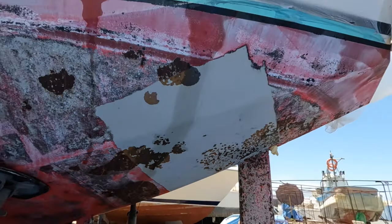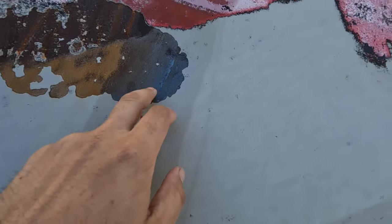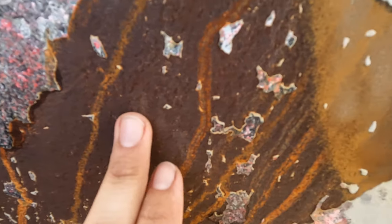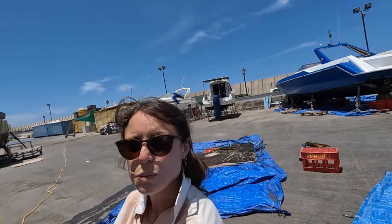It's a nice white patch where the anti-fouling is gone — we managed to get back to epoxy quite smoothly. But where we went down to bare steel, the flash rust has already begun. This is wet steel and it's immediately flash rusting in multiple spots. Everywhere we had a good surface for painting, the flash rust is remarkable. So going back to bare steel with this wet method on a steel boat is questionable — though you probably still gain some surface contact for painting.